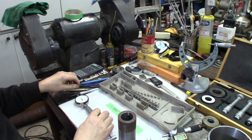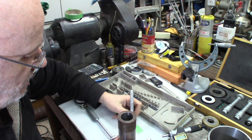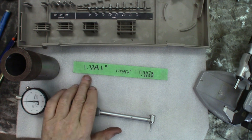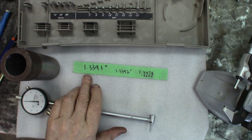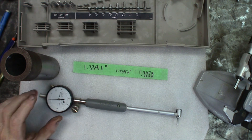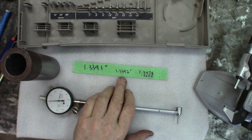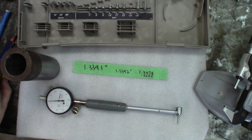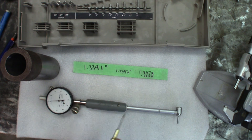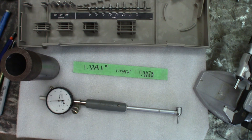Let's go and subtract this. If we look at this first control measure, we get this with the three-point micrometer. We compare with the gauge here — we're very close. We read some kind of more direct reading. We get this is one tenth off — which is excellent. There's repeatability, and depending on where in the bore you take the measurement, so that might vary a little bit.